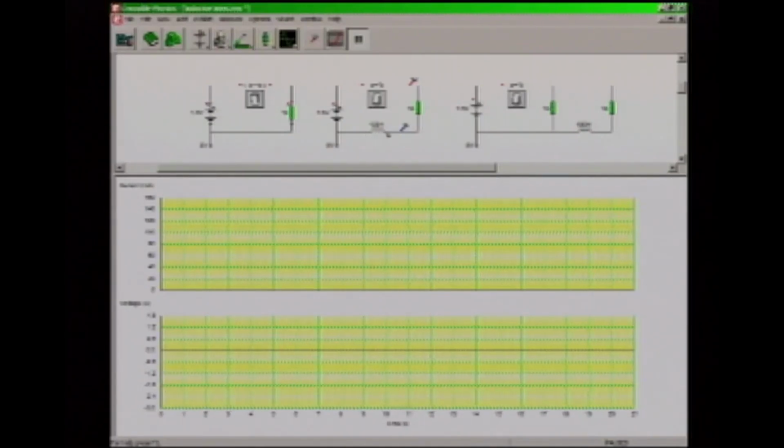So after a long time, the inductor is essentially just a conductor, and we have a 1.5 volt battery and a 10 ohm resistor. So the final current will be 0.15 amperes or 150 milliamperes. So I initial we predict will be 0. I final will be 150 milliamperes or 0.15 amperes. So let's see what happens when I close the switch.